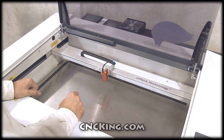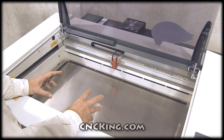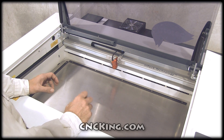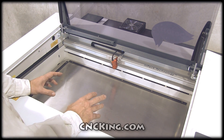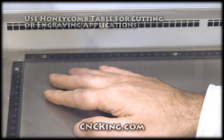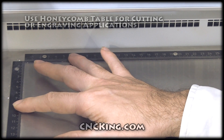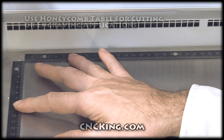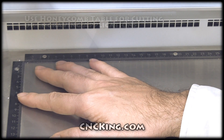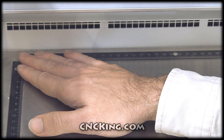When you're cutting stuff, it's more a function of the power of the tube. But when you're engraving, that's when it really shines because you can speed through stuff. Looking at the bed in a little bit more detail, you'll notice there are two rulers screwed into the bed. You can take them out if you want, but they're really nice for positioning material because you have exactly a 90 degree angle and they're not moving around no matter what you do.